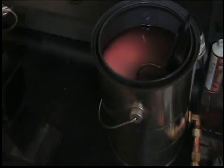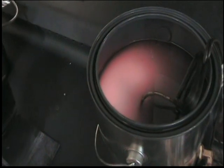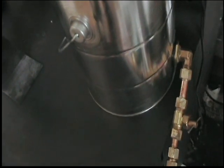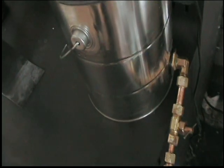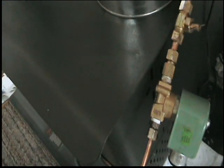There's a small tank of waste vegetable oil with a 100-watt light bulb in there, because when that oil gets cold I like to be able to turn on the 100-watt bulb for a little while to heat it up. We have a small needle valve — three-eighths inch copper fittings and a compression needle valve. There's also a 110-volt solenoid valve, stepping down to a quarter inch so we can feed the oil into the door, then adapting back to three-eighths to feed the pipe burner.